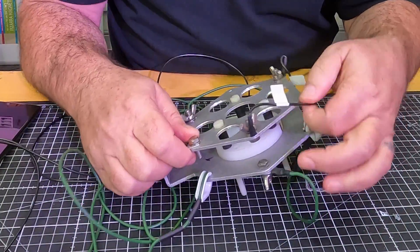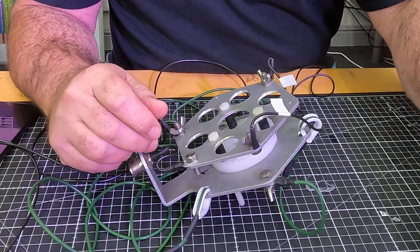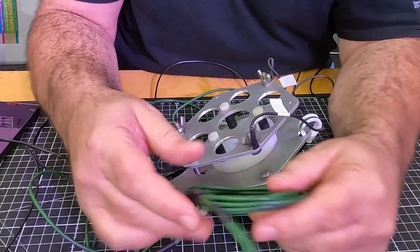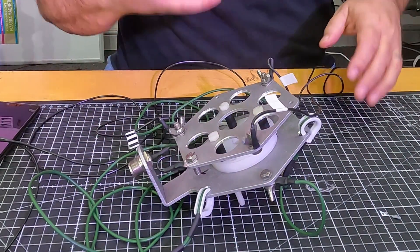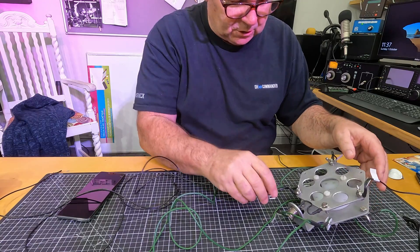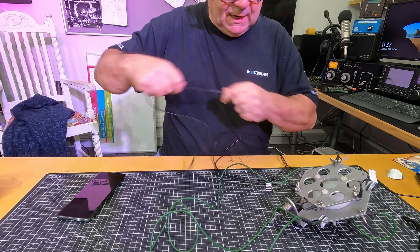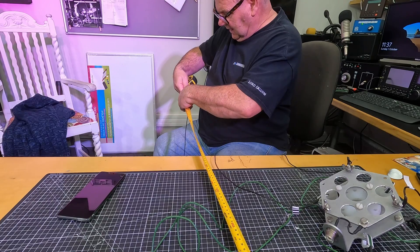The elements came off here in a shared arrangement, like a DX Commander. The reason the radials are shared is I didn't want 12 or 9 separate radials, so I pitched the radials roughly halfway between 10 meters and 15 meters. It's shared radials - and actually it's quite easy; I should be able to give you the dimensions. It's basically a quarter wave with three radials.